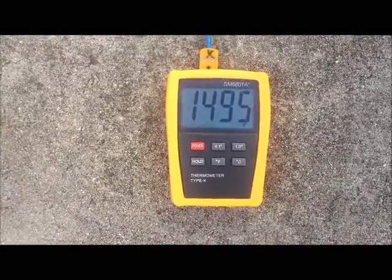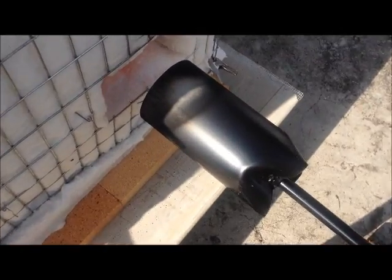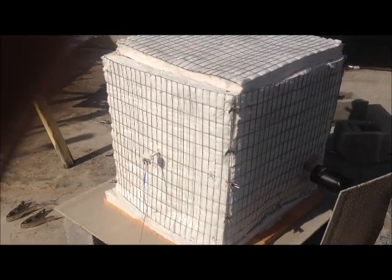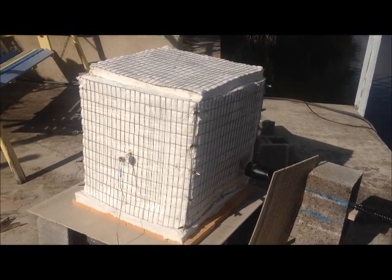Getting up close to 1,500 degrees here — five more degrees to go. Once again, I have not changed my flue setting. I have bumped up my burner speed several times. Now you can see it's a blue flame for sure. If you look inside, it's getting red hot in there. Not firing in reduction — there's no flames coming out here. So it's still efficiently using the propane. The thing is radiating some heat, but it's cooking with gas and looking good. I'm pleased with the way this firing is going so far.